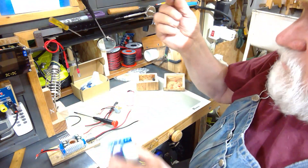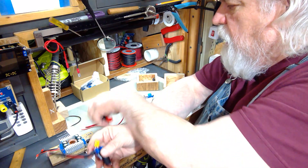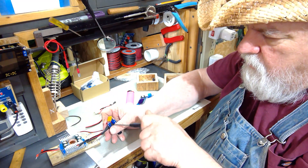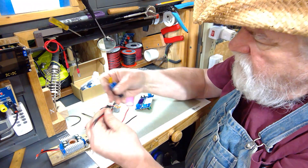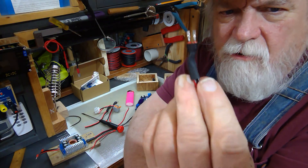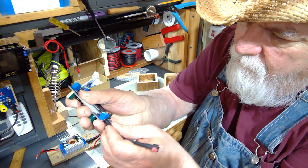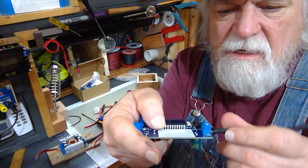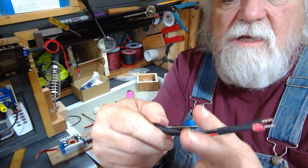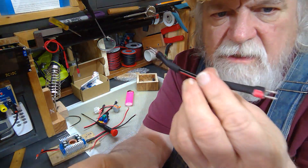It's a great little plug-in — easy peasy to make. When you're done and it's cooled, just take it off like so and you have a connector just like that one. You can now take this and put it on virtually any terminal or terminal block — it's a universal plug-in. All you have to do is cut it and you have two quick plug-ins ready to hook up to your module easily.